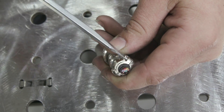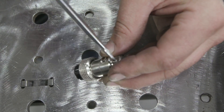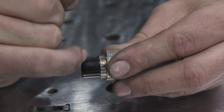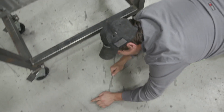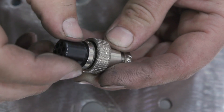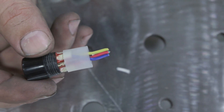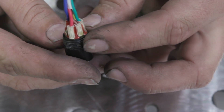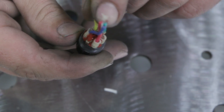Just by looking at this, these screws right here - same thing as the first connector - undo this and the little clip comes off that holds the wire tight. There's a set screw holding this black piece in. We're going to take that out - I dropped it but I found it - and this black thing will come out away from the silver piece. Turn it counterclockwise and there's that piece. We got this all apart, so we need to go look in the Everlast manual and find the wire diagram.